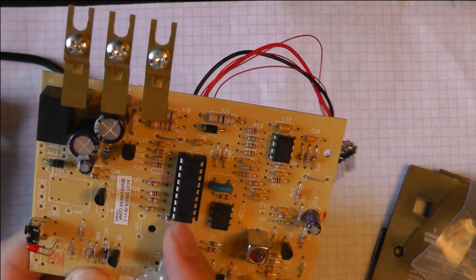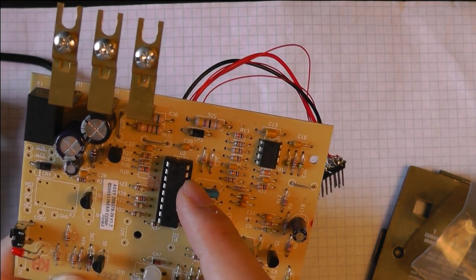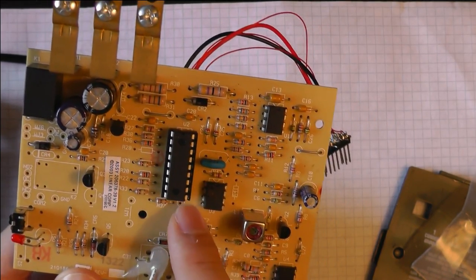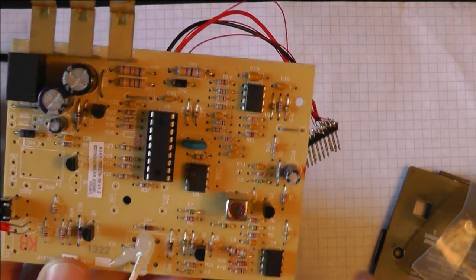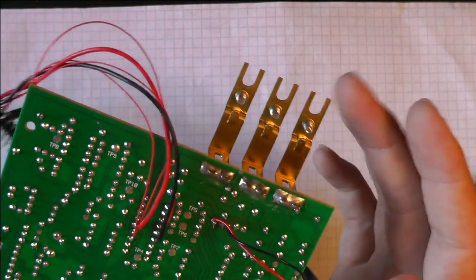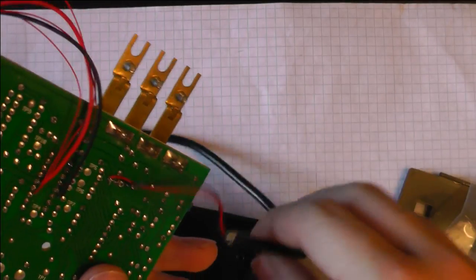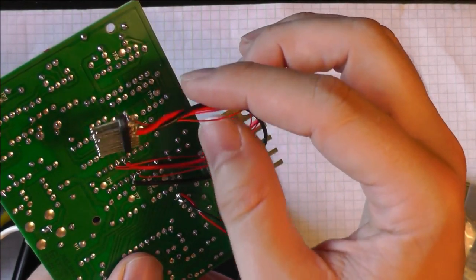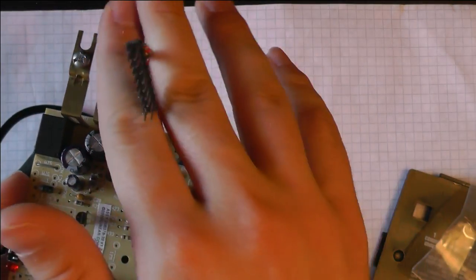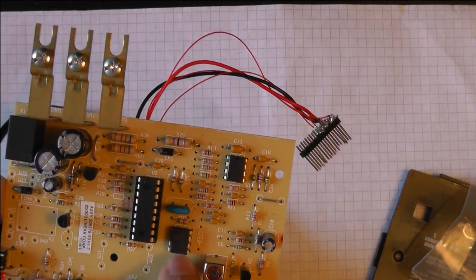This bigger chip provides hardware I2C, but I couldn't use it because it's on the wrong pin, and also because they don't use open collectors — they really do software bit-banging. So I had to reimplement the whole receiving part. The signal comes from the op-amp. I also reimplemented the whole I2C stack using software bit-banging between this chip and the microcontroller, which wasn't too hard. I also tapped on the voltage regulator so I can provide 5V via USB instead of 24V.